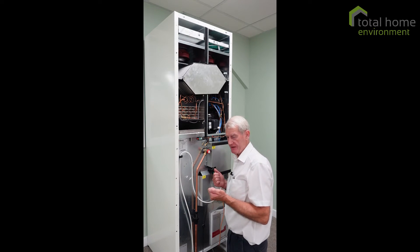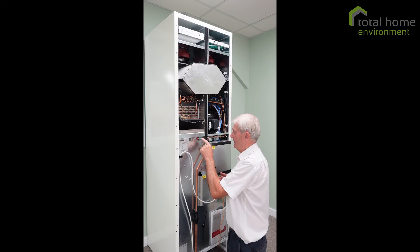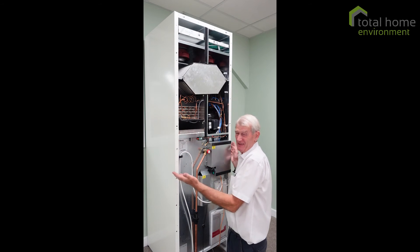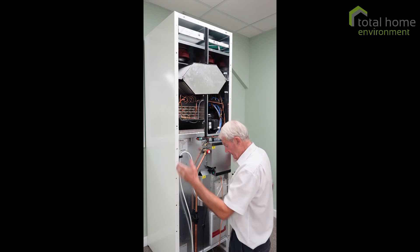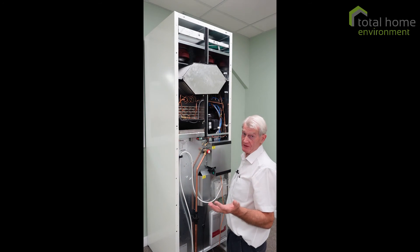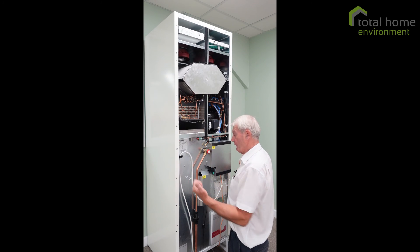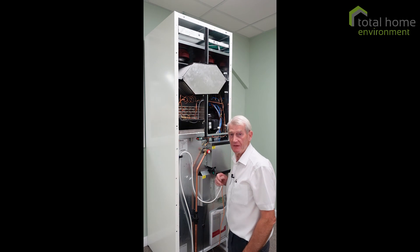To reset your pressure stat, you simply press the little red tip and you'll feel it click in. This one doesn't click in because it's not tripped — it's a kind of dummy unit. But anyway, that's where it is. You need to take the front cover off; it is four set screws with an Allen key head. Once you've removed that, just press the button and away it will go. Thanks for watching.